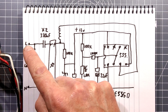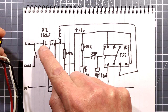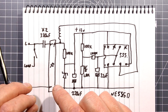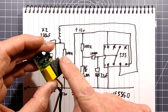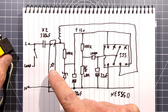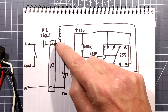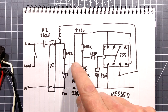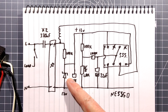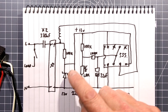What they're actually using it here is kind of like a Schmitt trigger and buffer driver - basically looking for an upper threshold being reached and then a lower threshold to toggle the output, then driving high current to act as a level snap switch to turn the relay on and off. The mains comes in here and goes to this capacitor, a 330 nanofarad X2 dropper capacitor, which limits the current in each half cycle. That makes it easy to derive a low-voltage supply - though not isolated from the mains - to drive the relay coil.